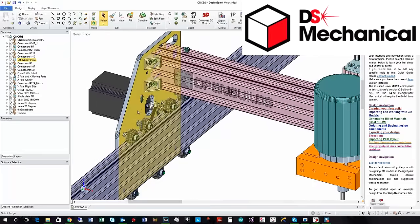This is one of the gantry plates on the left side. You can see here the wheels that are getting mounted on the top. We have regular spacers. You've got the GT3 belt coming along the inside of the trough of the 8020 extrusion, comes under the belt, under the wheels, up over the tooth wheel connected to the stepper motor, back underneath and all the way to the end.